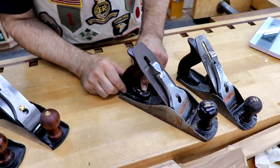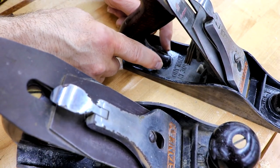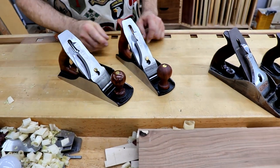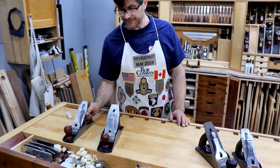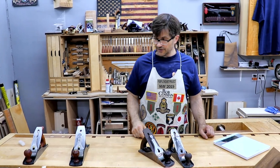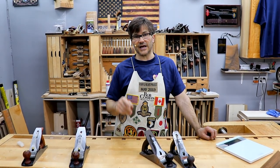You'll also notice the four and a half typically had a toe screw, while the four didn't — it has a cast point that fits into a notch to keep it from swiveling. On the Wood River, they had a toe screw on both, so I thought maybe they were the same size, but they're not — this one is definitely smaller. So if you are an adult male looking for a good smoother, go with a four and a half, whether it's a Lie-Nielsen, a Wood River, or whoever else makes one. You'll find it's a lot more comfortable for your larger hand. If you're a smaller person or female, look for a number four. But remember, their job is to smooth, not to flatten. Hope this helps.